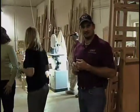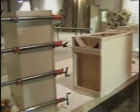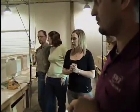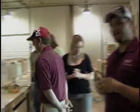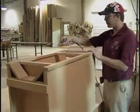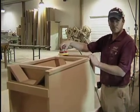Right over here we have a cabinet that already has been faced and nailed on. The putty holes are all filled with putty that matches the cabinetry. Rob is going to jump in here and show you, we 180 the face frame after the initial sanding through the time saver. This is our final sanding and prepping for the finish room.